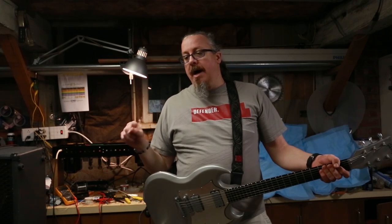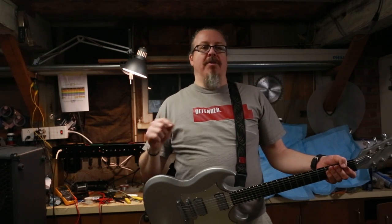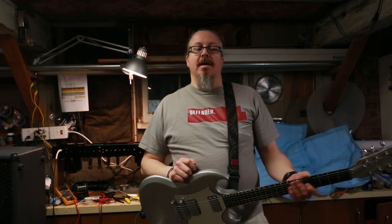I don't know. But once I restored those, it sounds really good. If somebody has any idea why an oscilloscope would do that in a tube amp at that last stage, please let me know. It is linked into the bias circuit and a few other things, so it's possible that was leaking back in, and as soon as I connected that oscilloscope to ground, it caused some weird issue. I'm open to anyone telling me what those issues were, but hey, I've got an amazingly cool sounding amp out of it, and I'm pretty stoked.